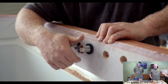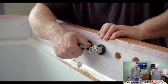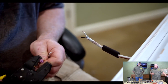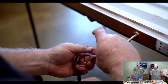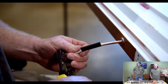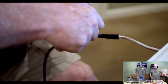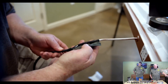With the foam there's a little bit of an issue — you can't get the shanks tight enough because the hardware starts to go into the foam and just keeps squishing in. So what I did is I cut a board and put a board there on the inside — we'll show you that later. Now I'm talking about the electrical. I'm using butt connectors here and just putting the wires together with those. You can actually use a torch on these particular ones and they'll melt into the wire and give you a really good finish. Those little sleeves on the side are also made to heat shrink — you can see me doing that here, and what that does is really clamp up against those wires so they won't pull apart when you pull the plug. Heat shrink is really good to use on electrical fittings. I also put some waterproof outdoor tape on there — it's super sticky — and then a little electrical tape on the side, so now nobody could trip on that and pull the wire out.